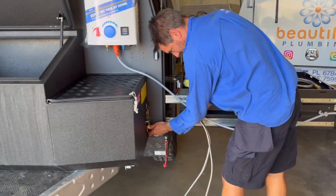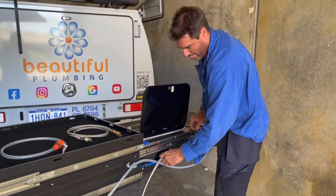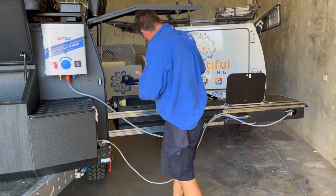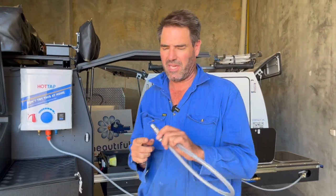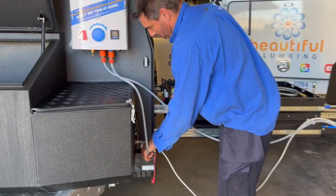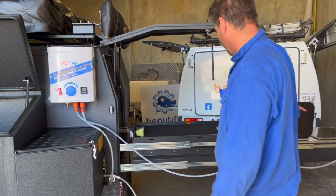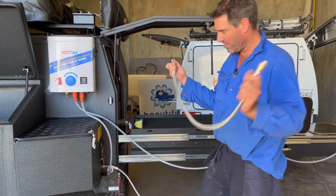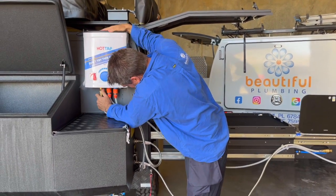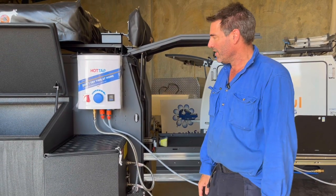The other hose from the stove can be stored in there, which is a great idea. So pick out your bayonet you want, pop the dust cover out, pop it in — and that just grips on. So now you're connected to the gas. You can just hold it up there. When the pump is on, the Adventure Kings come with one of these fittings so you can put that onto the hose. Hook your cold water on there first and that will just pop into the little fitting that's already installed. Now you've got cold water. When you turn on the hot tap, it'll run through and go to the kitchen sink. Then you've just got the gas pipe — pick your bayonet, pop it over. All hooked up. No way that it can actually get up there, so you can just light it off and use it that way.